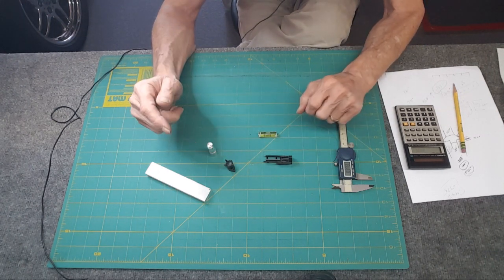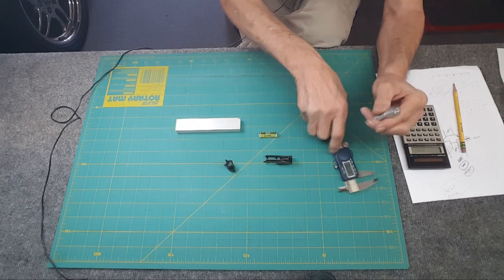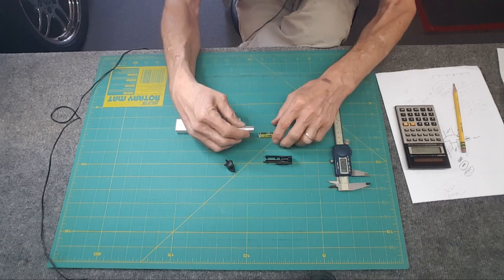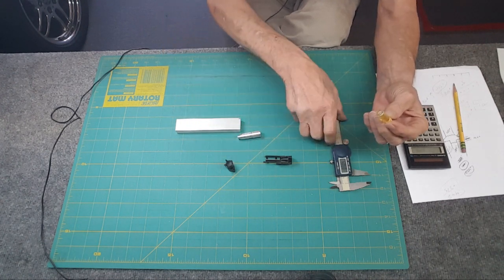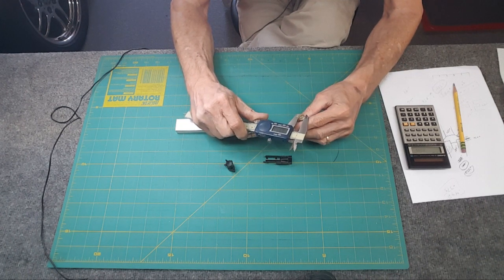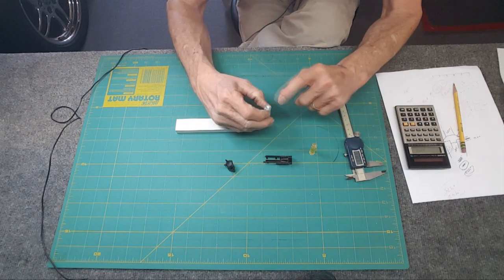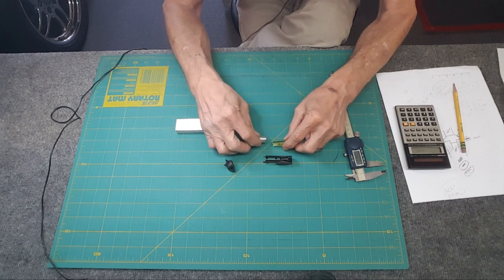I was hoping this was half inch — it measures 0.499, pretty close to half inch. It looks too big on this block but you put it up against this and whoa. Measuring the pocket size — it was about 0.372, so a 3/8 end mill at 0.375 will give me the pocket. I'll probably put some JB Weld or glue in there to hold it in place.